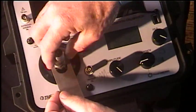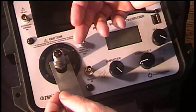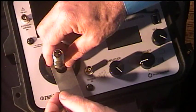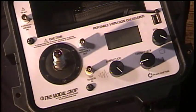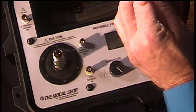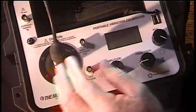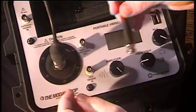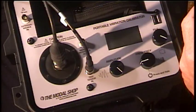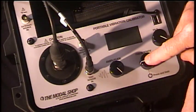I'm going to show you how easy it is to do a calibration. I'm going to take my sensor and screw it into the shaker table, being sure to use my backing wrench. Normally when you put a sensor in you would use a torque wrench — it's always important to torque the sensor onto the device using the manufacturer's recommended torque.